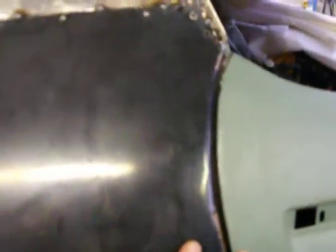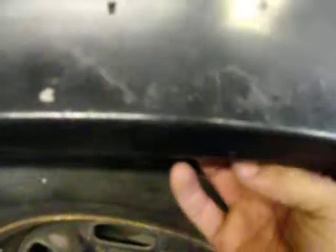All those welds are going to be ground smooth, metal to metal — you won't even know there's a skin here if the body work is done correctly. It was a pain to get this to fit. The line is nice all the way up — it's a little rounded here on this panel, but that's the way it came. I'll do some hammer work to get this edge further out; it'll flatten the panel. Below, I have to take the wheel well, dolly them together, and put tack welds in so it becomes one piece.